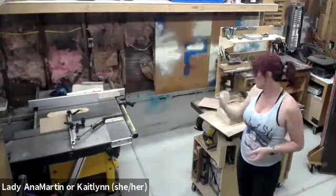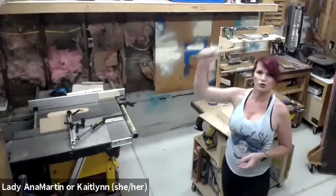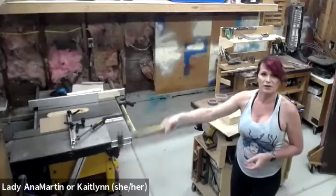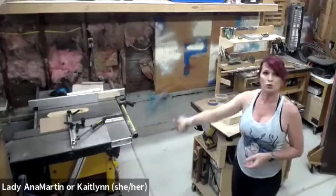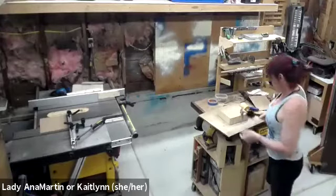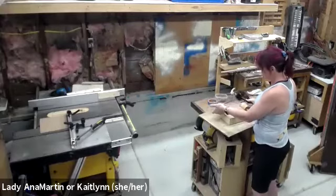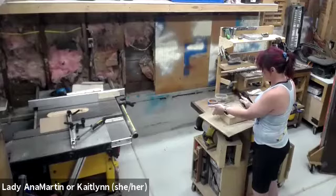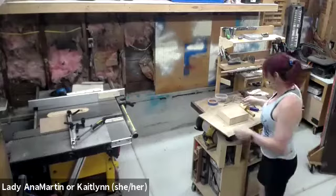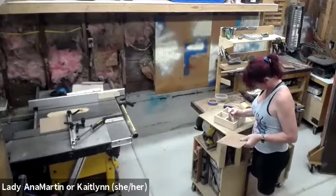My shoulder is only moving about that much. My elbow, especially if I'm using a larger hammer, is moving a little bit more, but my wrist is throwing this head down. And I'm letting the weight of the tool do the work. And if I do it correctly, on this hammer, which is bent, so it's a little hard to do correctly, I should be able to set the nail and drive it in three hits, two if I'm doing well. Set, drive, finish, like that. Let me do the same thing on the other side.